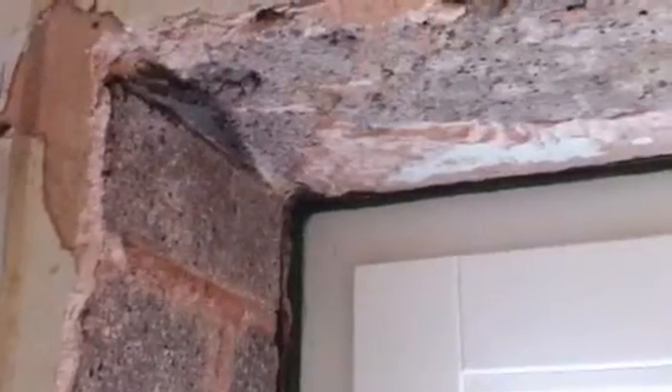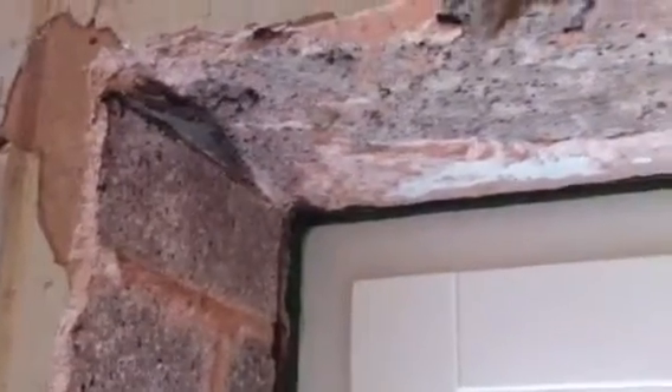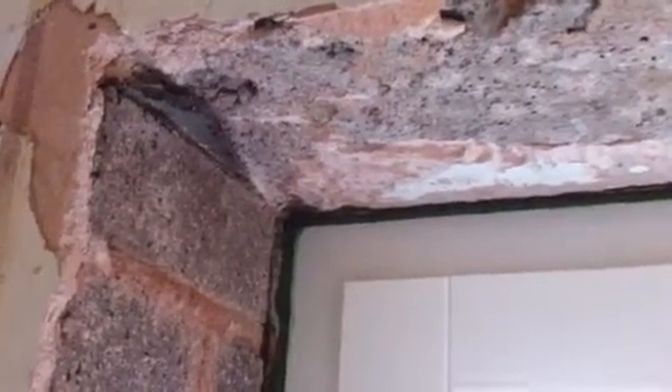And the brick skin, in turn, we're trusting is sealed, glued to the PU foam — so that should do the job. And then the cavity foam extends up right at the top of the house, and has puffed out into the flat roof zone, which then meets the foam that was put into the flat roof.